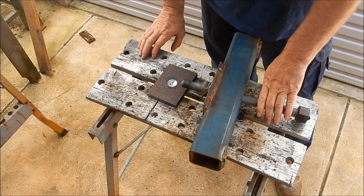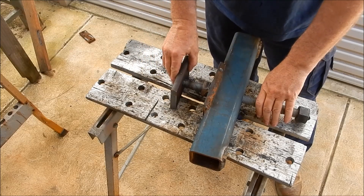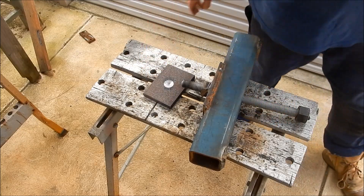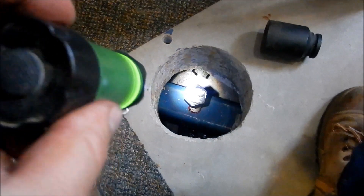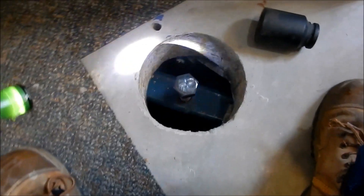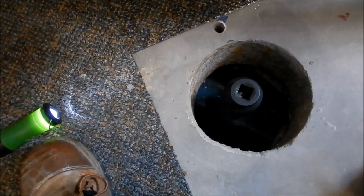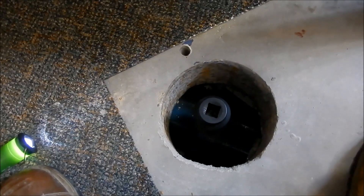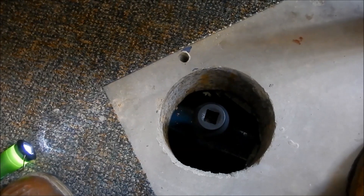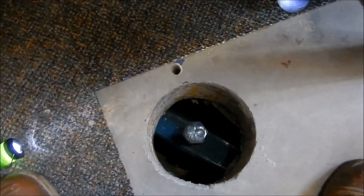The bolts are also high tensile, just plain black. I'll put this into place and show you how it all looks when it's down the hole. So this is what it looks like in place — you can see that bearing plate sitting on top of the pile. I've got a big socket on top with my big breaker bar, and we can tension that up and pull it up against the underside of the slab. That's how I did all the lifting — this makes a total of 32 piles that I'm supporting this shed on.